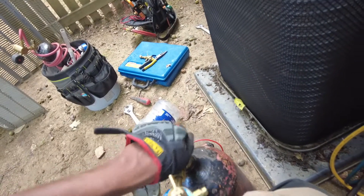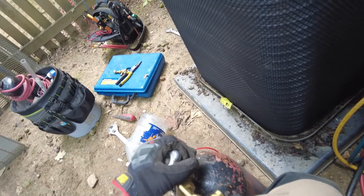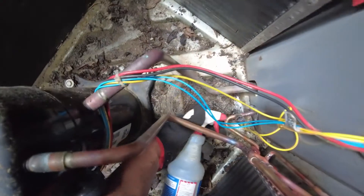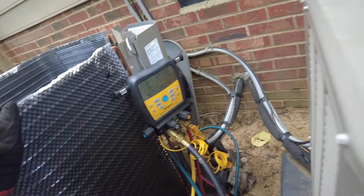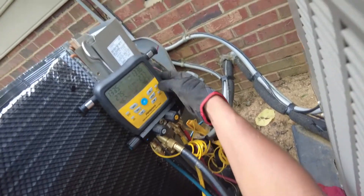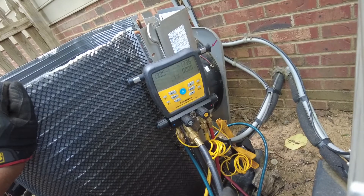I'm going to take our nitrogen here and do a refrigerant side — a refrigerant hose. I'd like to do a quick blast just in case anything got in the regulator. So basically I'm going to use my tightness test, using the suction line temperature as a reference — basically for the internal temperature of the nitrogen.